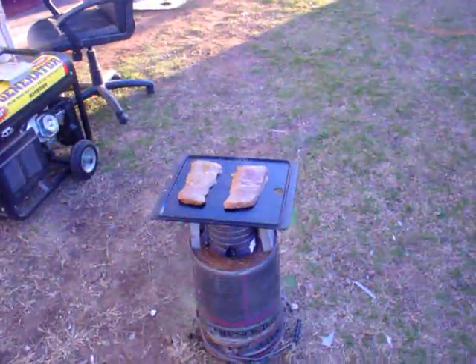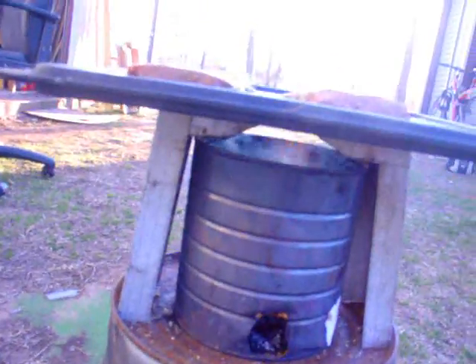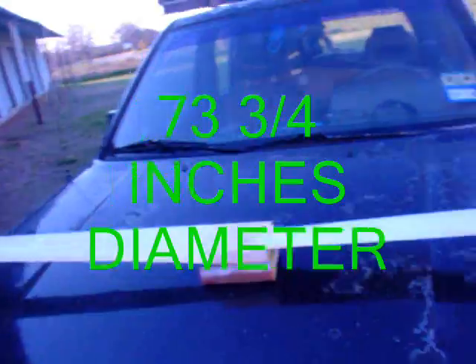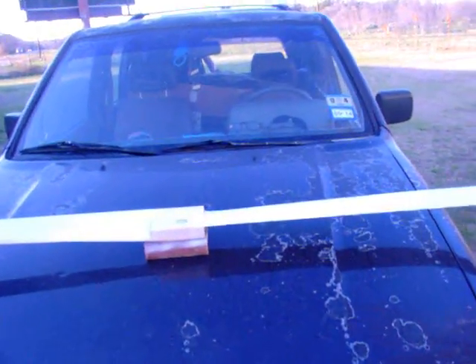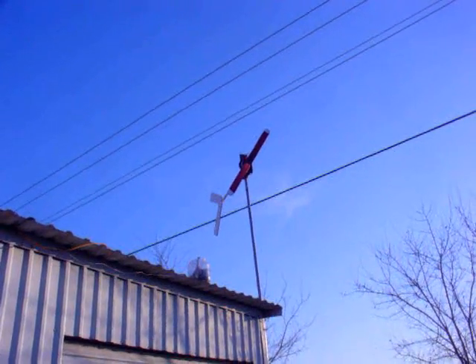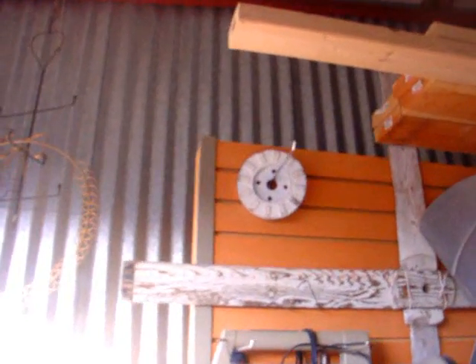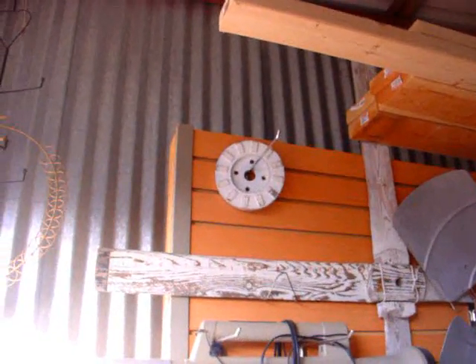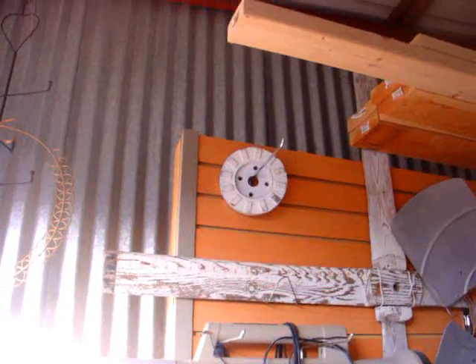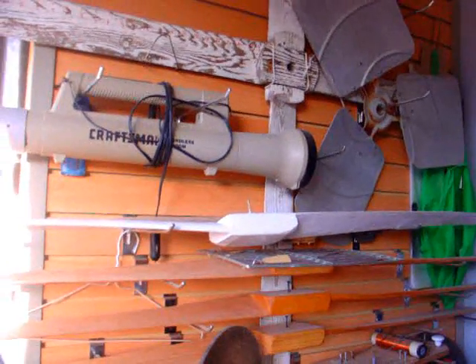Hello, I'm Scott Brown with Green Wind and Other Home Energies. We got a couple of stakes going on the rocket stove, flames looking real nice. I got a new prop over here — 73 and 3/4 inches — drying right there. I'm gonna put this other prop up on there with the longer prop to slow it down, put it in star, and see if it's got enough power to keep generating without stalling out.